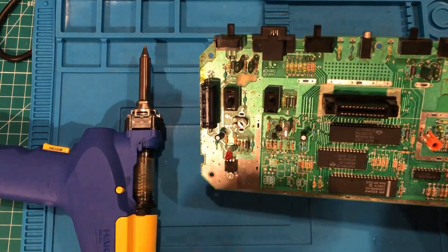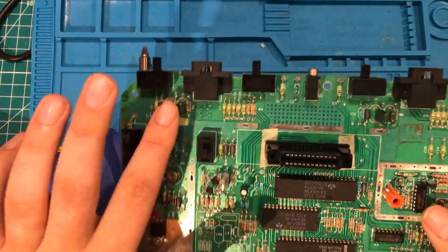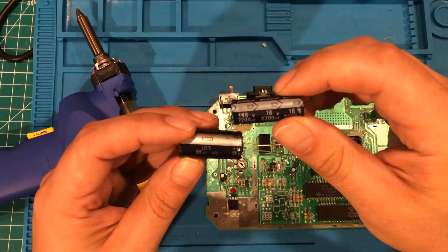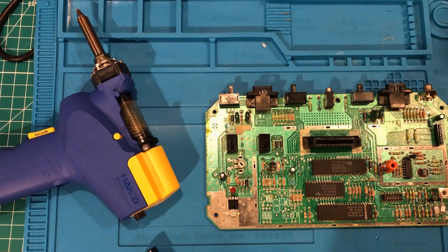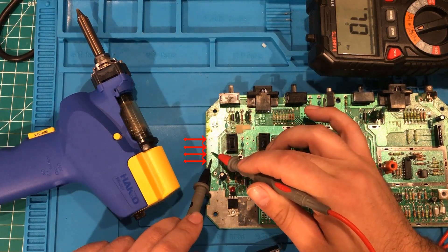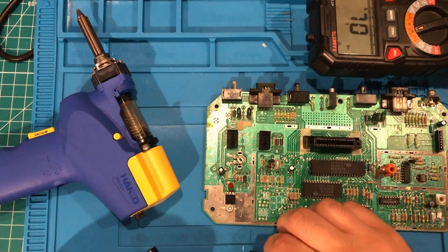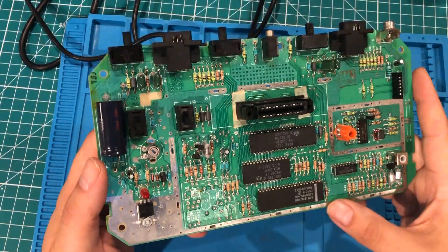While we're waiting for those PCBs, let's give this a quick recap. We're going to start with this 2200 microfarad cap, and there are four other electrolytics. I don't have another axial capacitor in that size, but with my meter you can see we're just going from positive to ground. All of these points are connected to each other, so you can actually put the capacitor anywhere along those lines - whatever fits - you don't have to find one the same physical size. A little bit much solder on this one but we'll call it good.